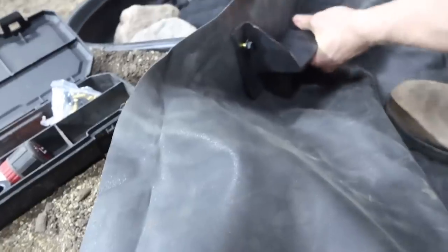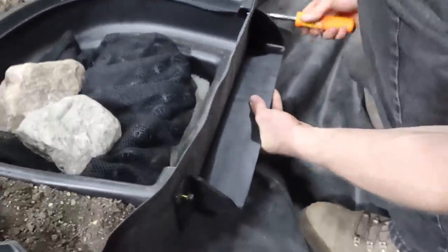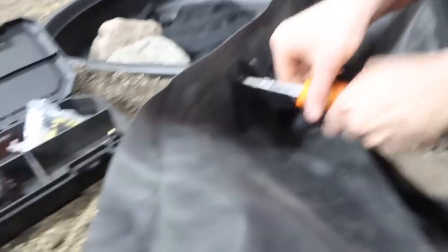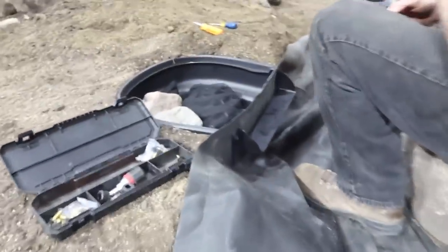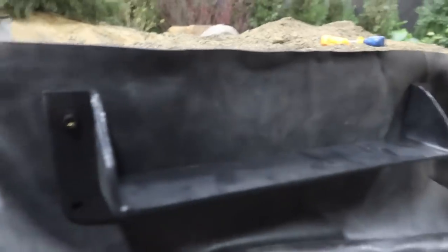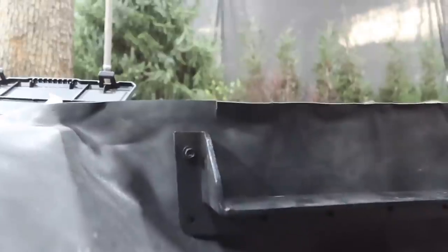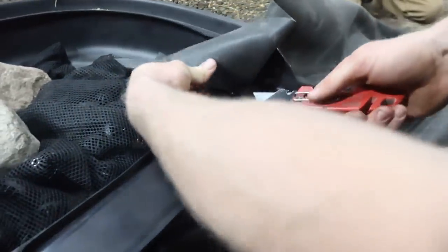He's got the first one in the corner, now he'll come over and put the second hole in. He's tightening them up — not over-tightening because we are going to pull these back out. He's going to cut the liner on the inside of the faceplate: run his knife going down, across, and then back up. Super important — you don't want to make a separate cut going from vertical to horizontal; you want to round or cam those edges. It's also important to have a fresh blade on your knife. You don't want to be sawing or hacking at the liner — just let the knife do the work. When he gets just above that corner, he'll start turning, going straight over, then get to the other corner and do the exact same thing in the opposite direction.